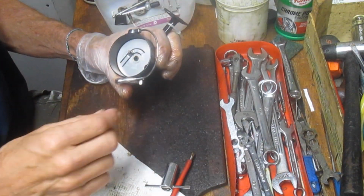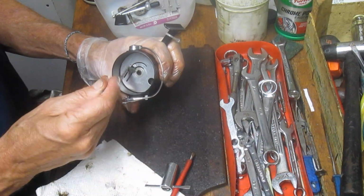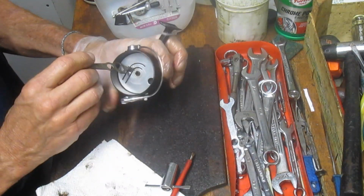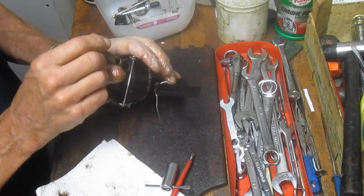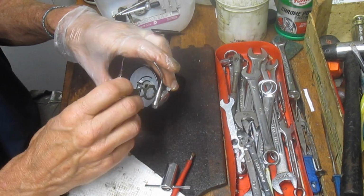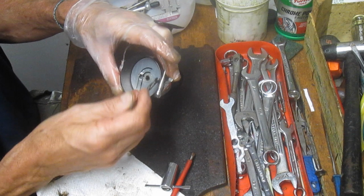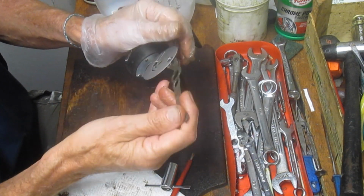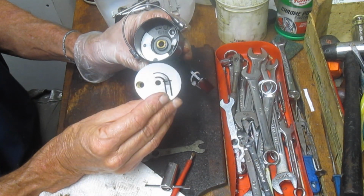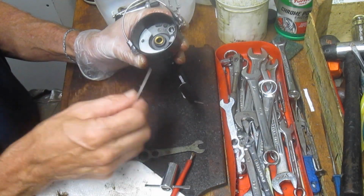Again, that's going to go in my parts tray. And then you can remove the metal plate here that acts as the trip lever. Now it's on a little bit of a groove, so you've got to bring it up evenly. And you've got to be careful with it. It's only an aluminum plate. Sometimes you've got to, there we go. Okay, oops. And this little hook on that side actually is what drives to close the throw mechanism here. So I just wanted to take that off.